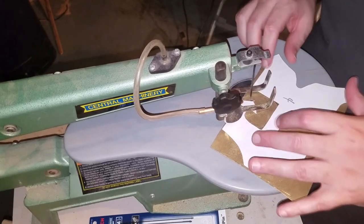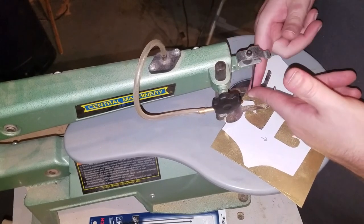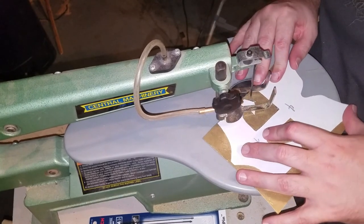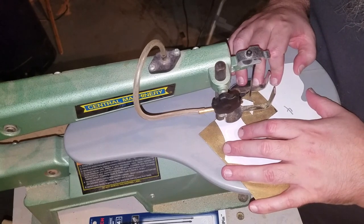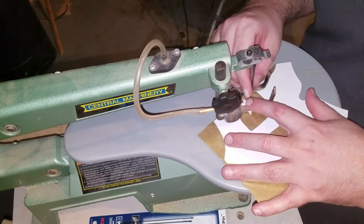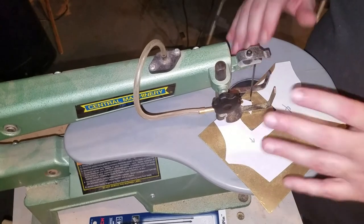But you have to get it to bite. These teeth on the side are staggered. So as I rub my finger across this, I can feel that there are teeth biting that point away from the blade itself. So I have to turn it, wait just a little bit, then it'll start biting, and then slowly push forward until it creates that groove that's wide enough to fit the face of the blade area. And then I just keep working it until it's big enough.